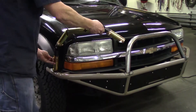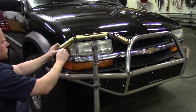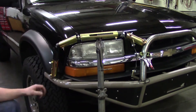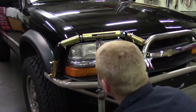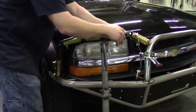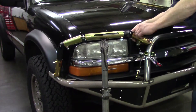Flip the cope, set it over to the right angle, then I can set it on the vehicle and adjust it to fit right. It's really important to have an adjustable stand to hold the jig while you're tweaking and adjusting it to fit just right. Then I can grab a tube holder, which is another product we make, that holds the end of the tube and allows me to adjust the entire tube jig all at once. Having the tube holder and the stand lets me adjust multiple bend angles and rotation all at once. I'm gonna raise the tube at the corner because I want it to be a little less of an angle. It's good to take your time while setting up the tube jig and make sure to check it from a lot of different angles to make sure the fitment is perfect, because the more perfect this fits, the more room for error you have when you go to make the final tube.